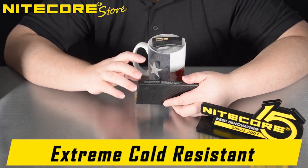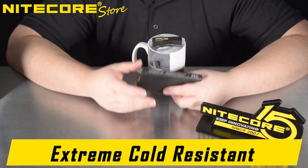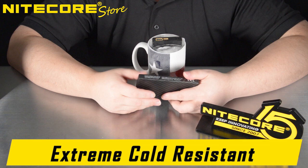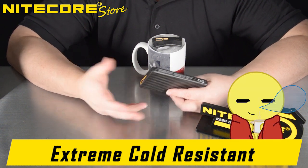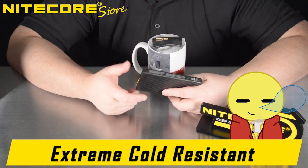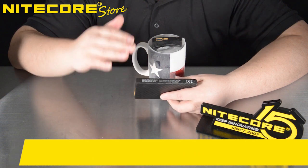As the temperature decreases, the lithium ions tend to not integrate fully into the graphite or carbon-based anode — it instead sort of plates the surface. Basically, at lower temperatures, just like how we prefer to sit inside, snuggle up with a mug of hot chocolate, and just be lazy, ions tend to operate similarly. They don't like to be as active when temperatures drop.